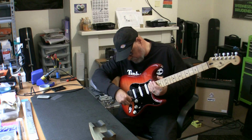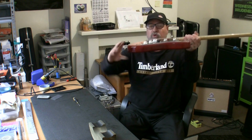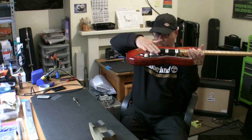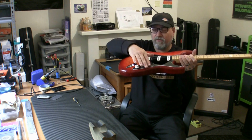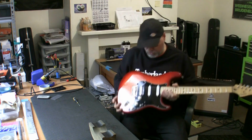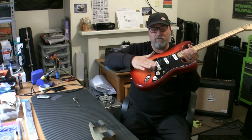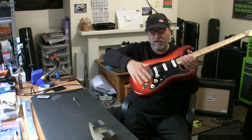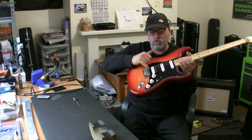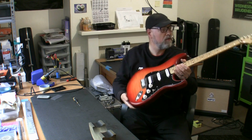I've also put a push coil split on there. We removed the super switch, put a normal Oak Grigsby five-way switch in there. I put the coil split on the push pot. I love push push. For tone on this, middle tone is neck and middle. This is just a tone for the bridge. With a push for a coil split, it'll cancel out this coil.